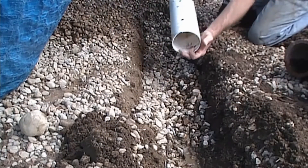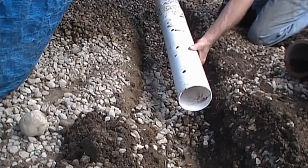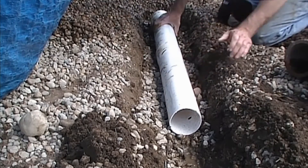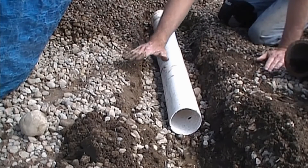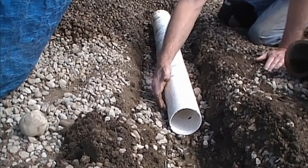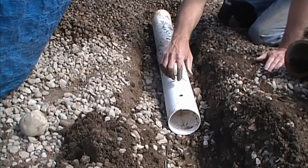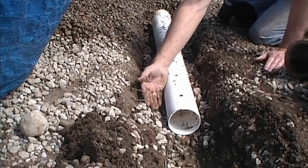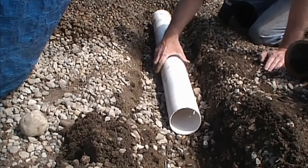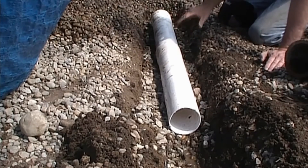Now we're going to simulate it with today's pipe. You can see there's holes on the one side of the pipe — this is the perforation, and these holes point down. We'll set that into the trench. As it rains, water comes down through the gravel and floods up into your pipe, and it will enter those holes which are on the bottom. If those holes are pointing upward, that water has to rise all the way up here before it can enter the hole. So we put our holes pointing down, and now we're going to cover it up with gravel.